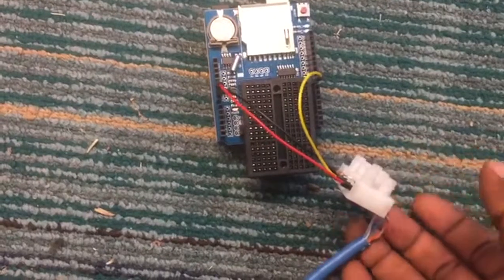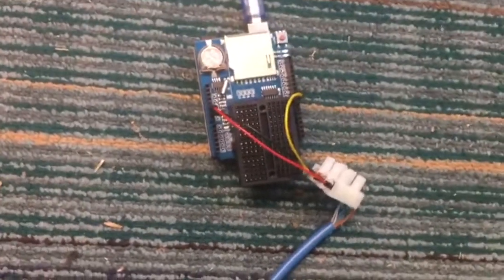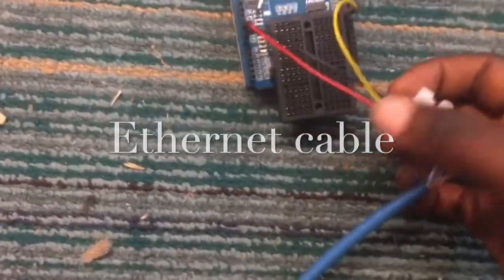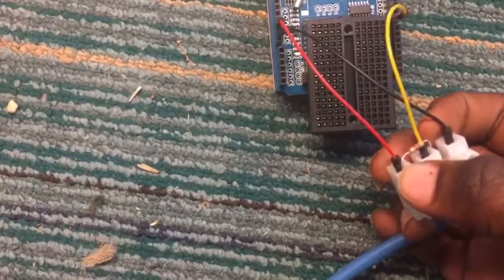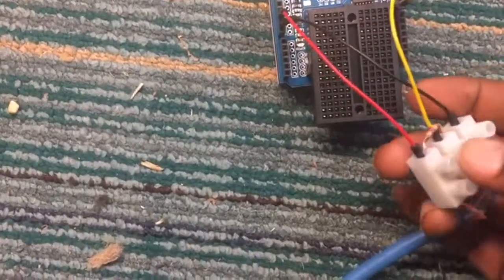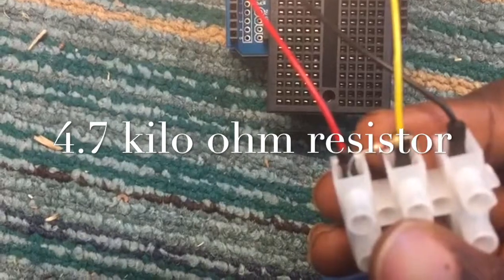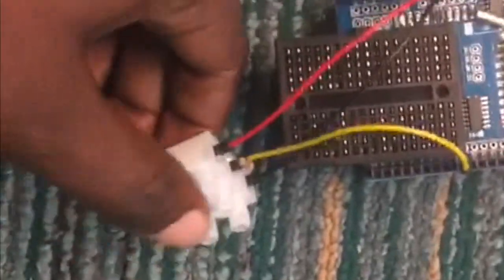But since I'm going to be using this in a large tank, I need a very long length, so for this project I've decided to extend my length using an extension wire — I think it's called the cat5 wire. Another thing you need to know is that you need a resistor to bridge between the signal and the positive wire. We're using a 4.7 kilohm resistor, and the color code for the resistor is yellow, purple, red, gold. You bridge it between the positive and the signal wire.